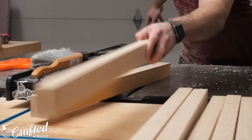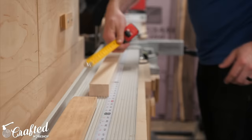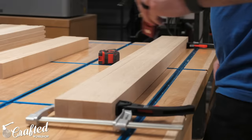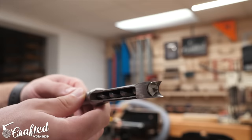The next step was to get the mortises cut into the rails to accept the tenons on the spindles. Before doing that I cut the rails to their final length at the miter saw. Next I clamped the four side rails together and started laying out the mortise locations — the mortises are centered on the rails lengthwise and are spaced evenly along the length of the rails with two inches between each spindle. Once the mortise locations were laid out, I moved over to the hollow chisel mortiser to cut the mortises. In case you aren't familiar, imagine a drill press with a specialized bit that cuts square holes.